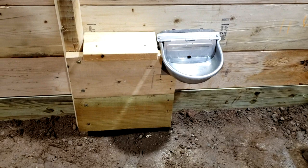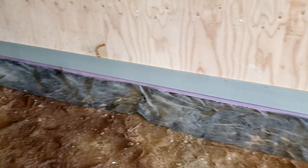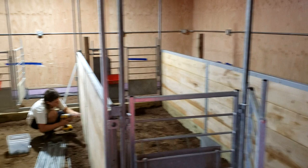So I'm putting in a rounded-end flat-sided post to give me the ability to build my box structure. This box structure can be removed with four screws — if you take off the four screws, the whole entire box comes off and you have complete access to all that water line underneath. I do this to protect it. Now I know the goats will stand on those boxes and on the waters — I get that. I trimmed everything out the best I could, covered up all my foam, and then we're going to put gravel on the flooring and eventually straw it.